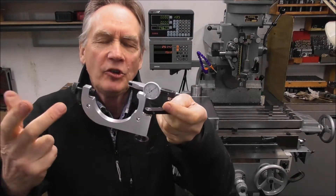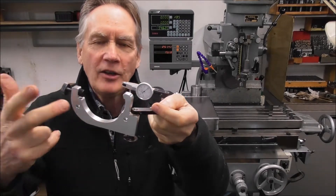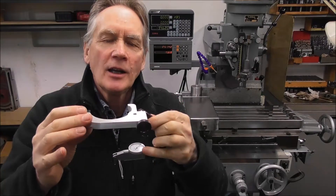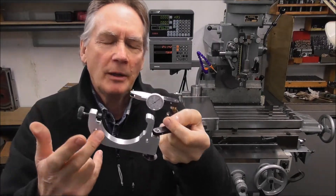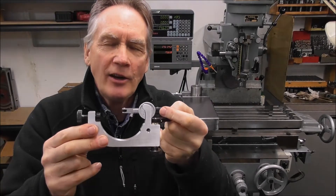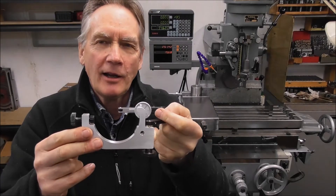If you've got a CNC machine and you want to make one of these, you can profile out this shape. I'll go into a method of holding the part which is to be profile machined — you could call it standoff holding or packer holding.